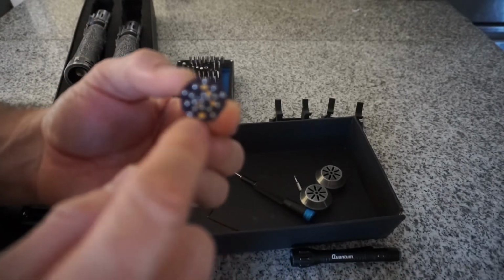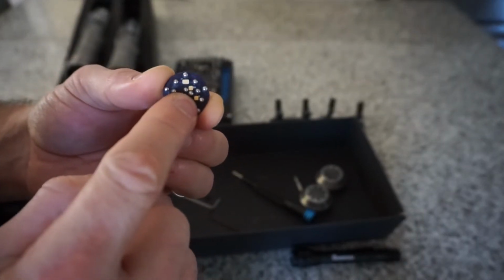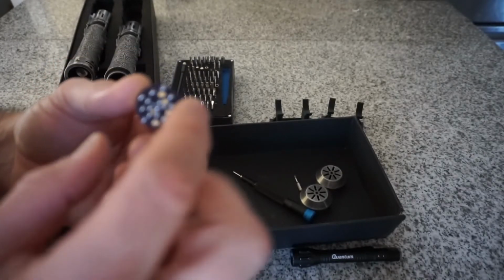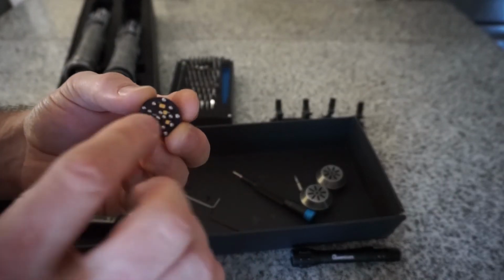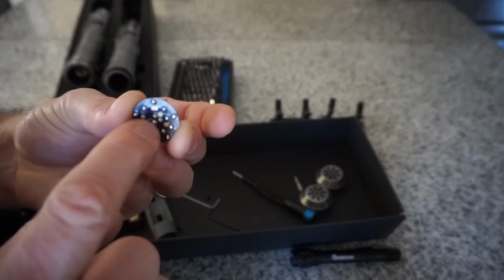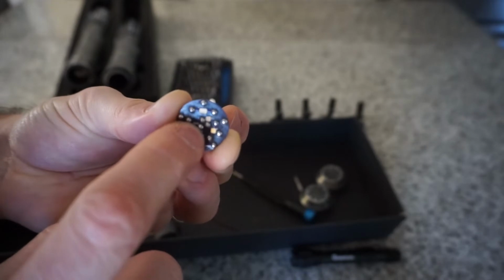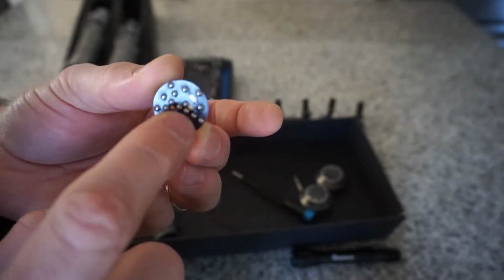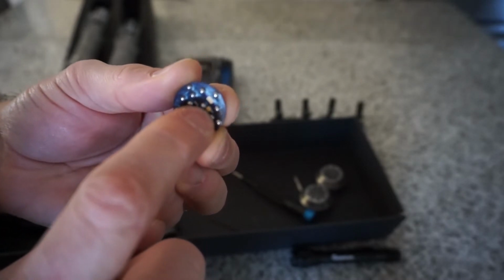Gotta get new batteries. So there's a pad here marked D for data. The switch ground wire doesn't have a pad. There's no pad for that. You just go right to the middle solder point. So that's switch ground. And then there's 2 more pads, button 1, which is a little bit larger than button 2 pad.